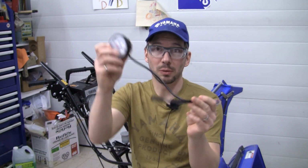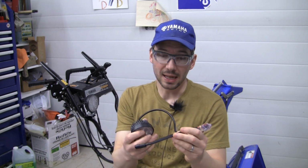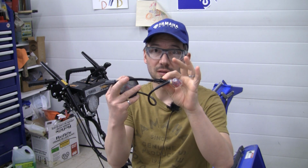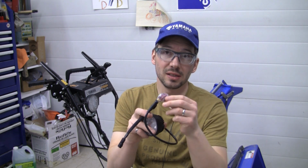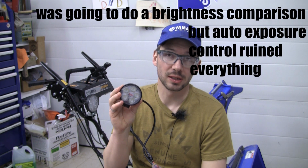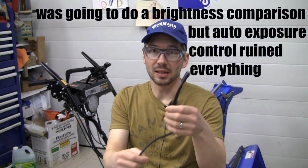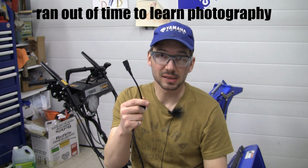So we've got the light and we've got a connector that plugs and plays into the snowblower, and then I've got a fuse here, a small glass fuse, 5 by 20 millimeters. And in this lump of RTV silicone, I've got an overvoltage protective device. The light is similar to the one before, except it's much smaller. It consumes about twice the current, and I think it's much brighter. The connector is the same connector that used to be on the previous assembly.